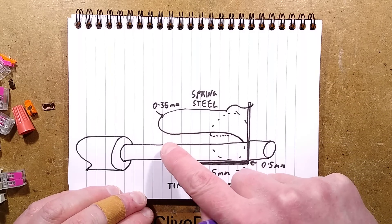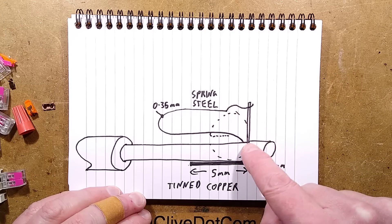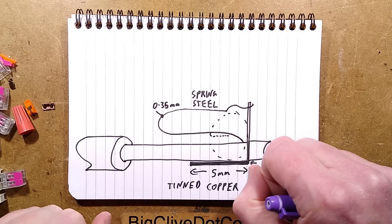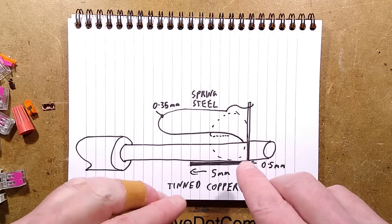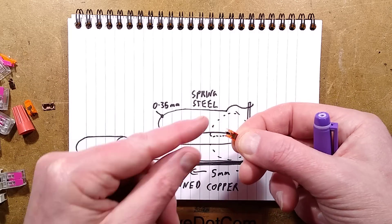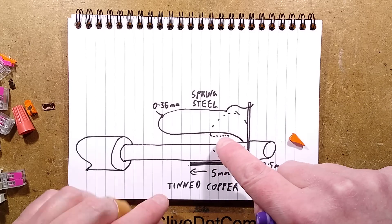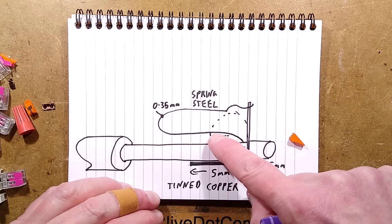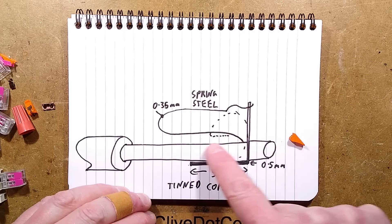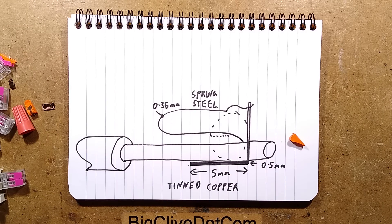With the original WAGO, when you hinge the lever up there's a sort of pivot — but it's just held in place by the spring, not with actual pins through it. It's basically a little curved bit that just rides up and down on the plastic, and it's got a cantilever inside that lets the wire through while also cantilevering up against the spring to push it up when you lever it up, to let you put the wire in. When you put it back, it just clamps down again — and that is more or less it.